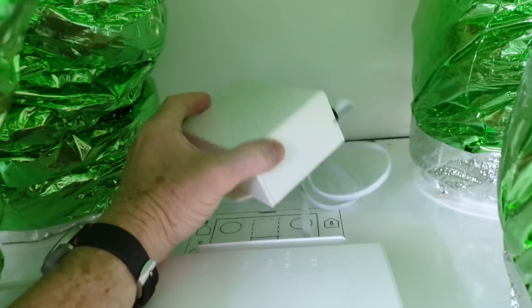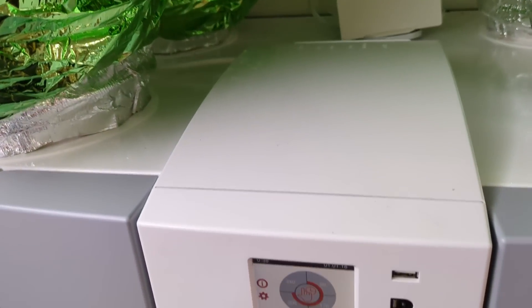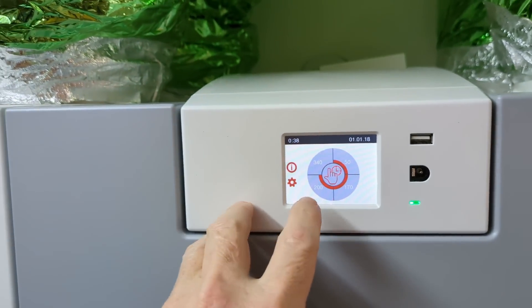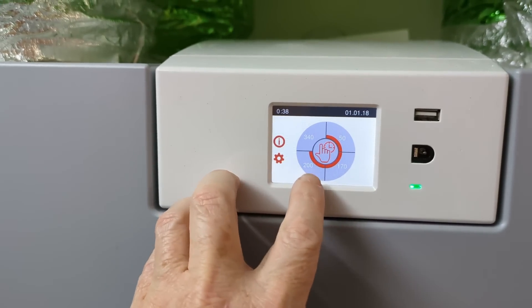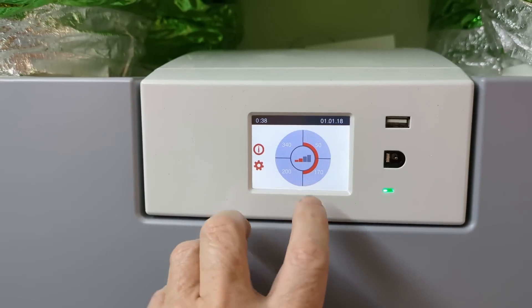There are actual connections on the back. This is a wireless receiver, and we've got a little wireless transmitter to change the modes. For example, if you go into the bathroom and you're having a shower and want to boost the air extraction, you can do that with a remote control on the wall instead of coming to the main control here. So this is just the main control — I've got it set to 200 but we can set it to 170; that's the flow rate.